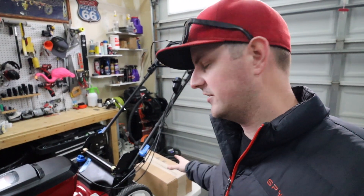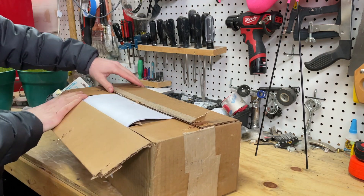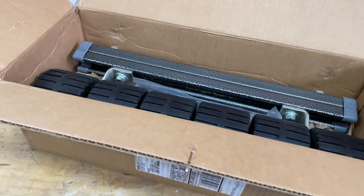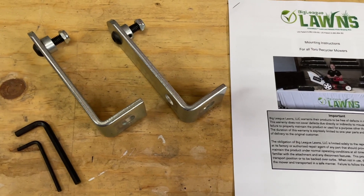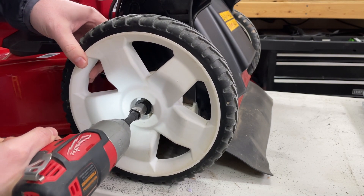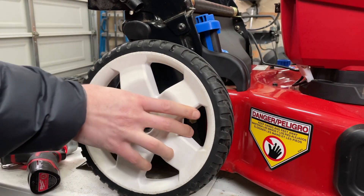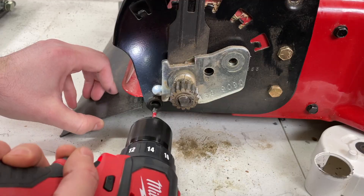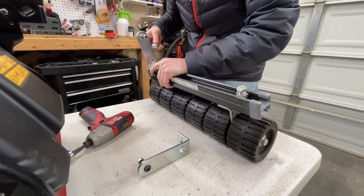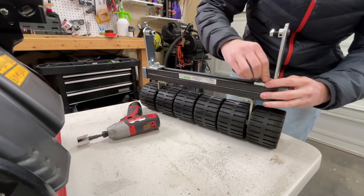So much better. Now I'll go ahead and unbox the striping roller and go over the instructions and show you how my quick connect kit will attach to this mower. The first thing you're going to want to do is remove the back wheels and the debris skirt from the recycler — pretty easy. Two half-inch bolts to remove the wheels and two Phillips screws for the skirt.